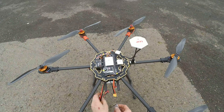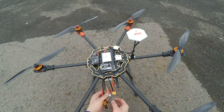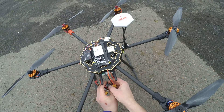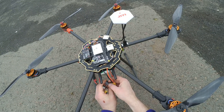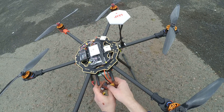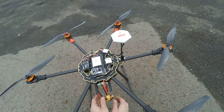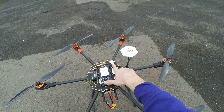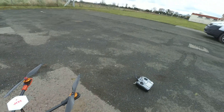So this is only for testing — I have no OSD downlink at the minute, this is the first initial test. Set the battery alarm to 3.8 volts per cell. That's everything powering up. We're blinking twice here on the LED for the flight controller, so I know it's booting up.